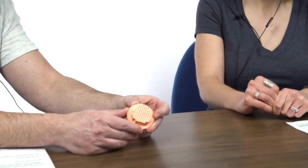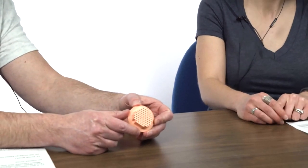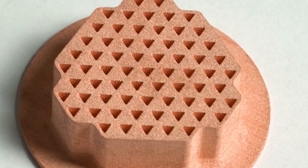The engineering challenge is getting porosity that is fine enough and tight enough to catch a virus, but balancing that with enough surface area so that a normal human with normal lung strength can draw air through. These triangular divots are a device for increasing surface area. The porosity running through this — so fine we can't see it — doesn't need to have pores smaller than the virus. It creates opportunities for those particles to get trapped: twists and turns and passageways that make it much more likely for particles to get stuck on a wall. It's not a strainer — it's a maze.